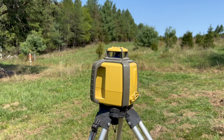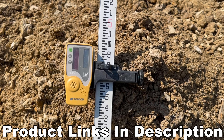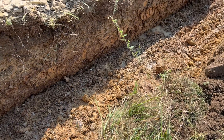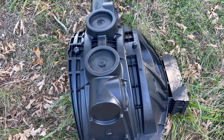The installer set up a rotary laser level — which is critical to installing the leach lines level, because they cannot be sloped at all. To begin and end each leach line, we install what's called a septic chamber end cap, which gets drilled out for the four-inch pipe to enter using the same hole saw used earlier on the septic tank.